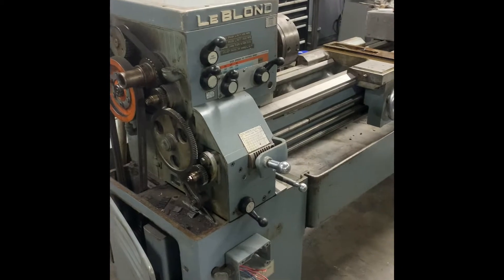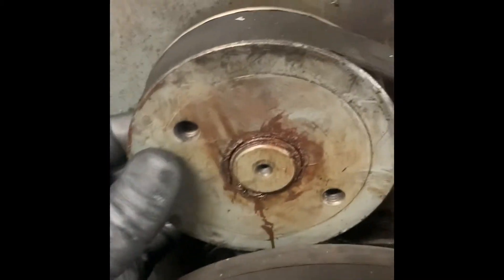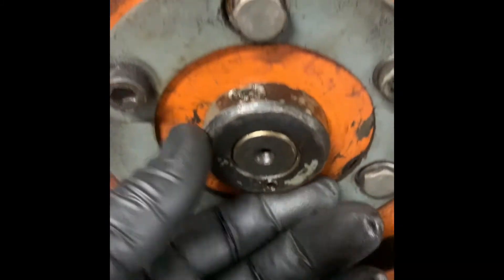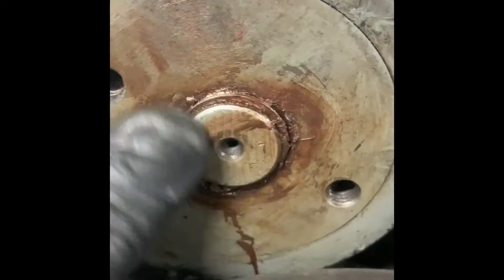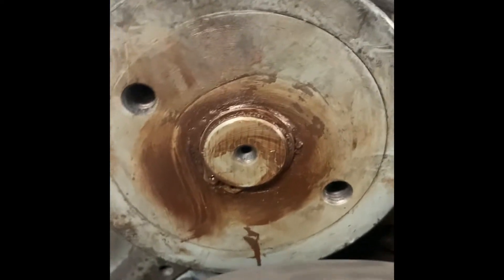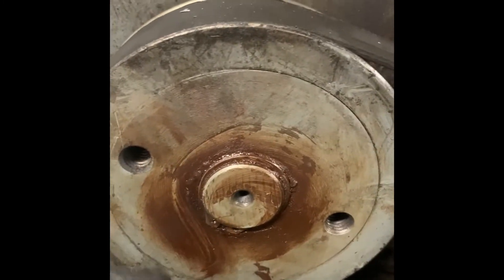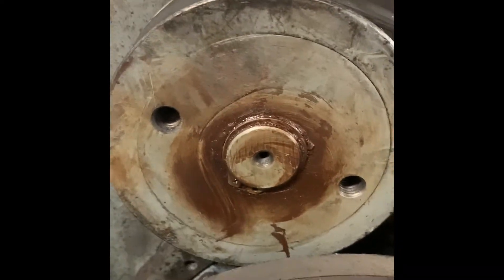A couple of quick notes before we get too far. Started stripping this machine down today, and just a couple of things to look for on these LeBlondes. I've posted a video a long time ago about some gearing, but here's another issue. The timing belt pulley on these LeBlondes was only fixed with a key and then a snap ring — there was no compression fitting or threading to hold it down, like on the drive shaft. Since it's not fixed as tightly as it could be, it wobbles out and gets worn out. The pulley is turning and the shaft is not until it engages at a certain point.